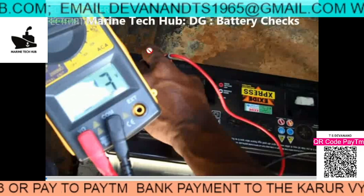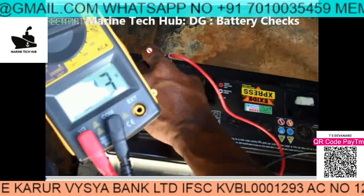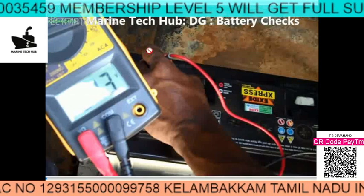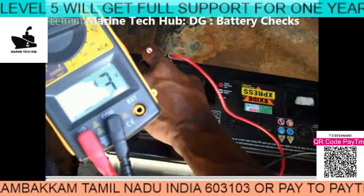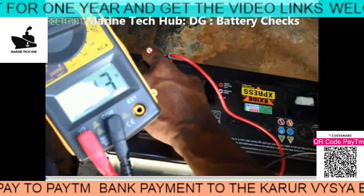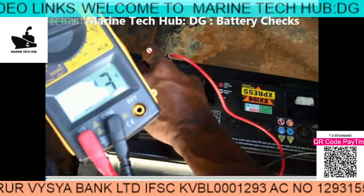The important message today is: do a load test on the battery, and if the battery is good, the cable can also be weak. Keep a spare cable for the lifeboat and for the emergency generator. Also, on certain equipment like igniters you have a 10,000-volt system for creating a spark for the pilot burner — those are special cables and their condition is very important.